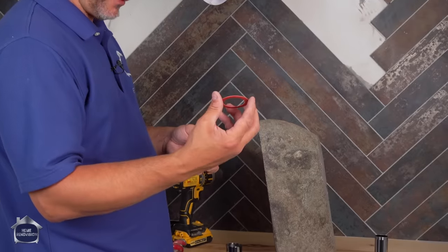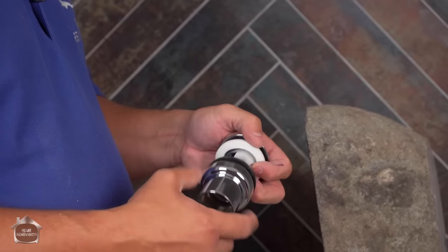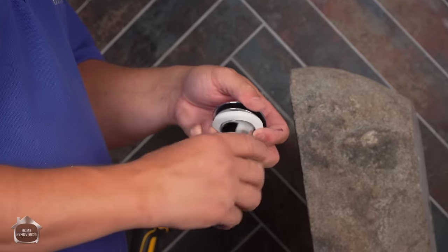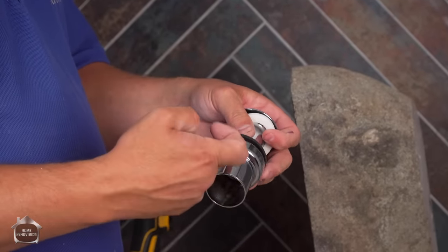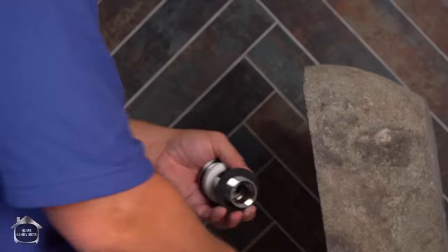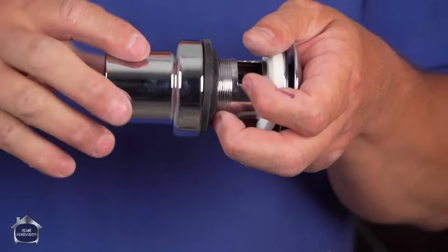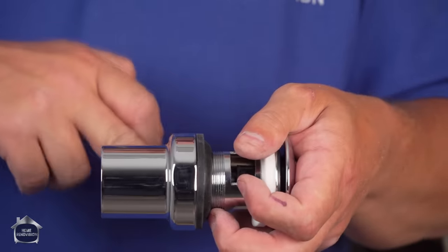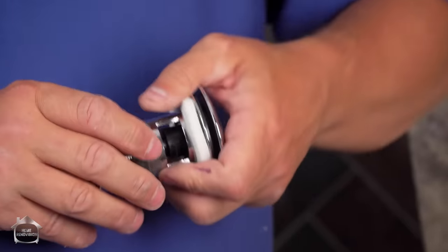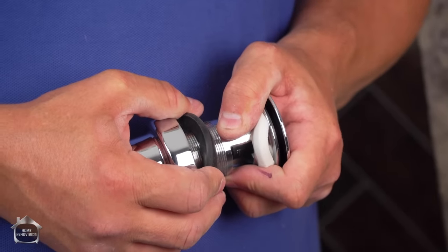Now this cardboard ring is actually quite vital. This is the piece that goes on the bottom. All right, and this is what causes compression for this gasket into the bottom of my stone sink. That cardboard ring there is actually what transfers that pressure into this. And I'll explain this. If I simply had this on here without the cardboard ring, because it's threaded, it's not coming on straight, it's actually on an angle. And so there'll be more pressure on this point than there is on the back. There's a gap. And so when you do that under pressure, it actually causes the gasket to buckle up like this. Okay? And when your gasket buckles under pressure, it leaks.